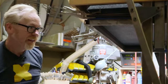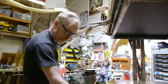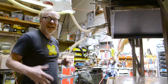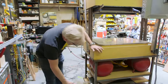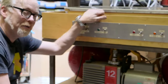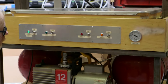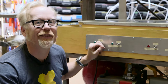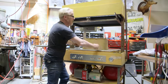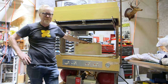Once this is up, I turn on the heaters. I have 12 heating elements in here and I can turn on six at a time with these two switches — I can turn on the odds or the evens. But before I turn any of those on, I want to activate the vacuum. The vacuum comes courtesy of these two five-gallon air tanks. I'll use this vacuum pump to evacuate both of these tanks. Now it is pulling a vacuum — when it's pulled a vacuum I turn it off. These tanks are now under vacuum, so once the plastic gets hot I'll pull it over my buck, activate the vacuum, and that will suck the plastic down over the buck — in theory.